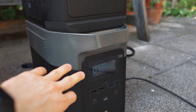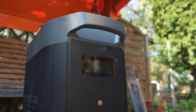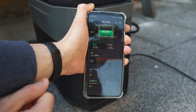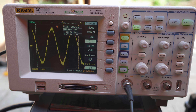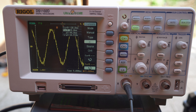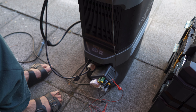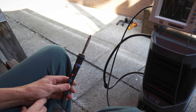It really depends on the specific balcony situation — how the module is mounted and how much sun you actually get. But it's a good start. While filming these videos the batteries climbed from about 53 to 60 percent, balancing quite perfectly. The app shows 280 watts of consistent solar input. We also checked the output sine wave — it looks quite normal with proper frequency. There may be some high-frequency distortions that would need further investigation, but it seems fine. The load tested was a soldering iron at about 100 watts.